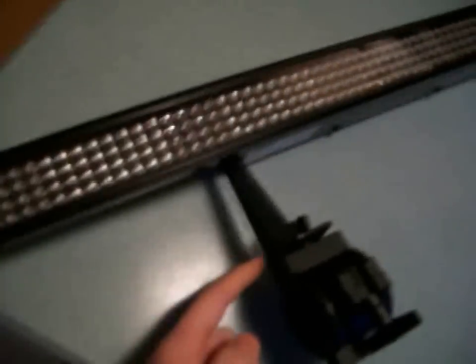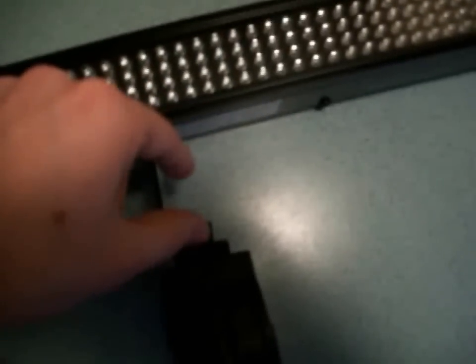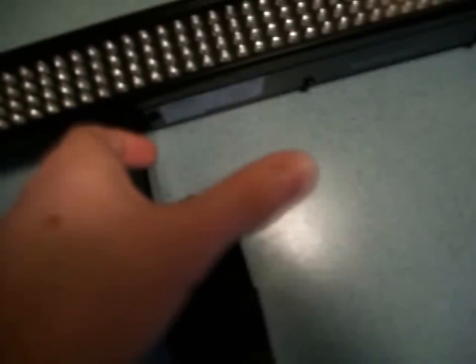You can do one of two things — I'll come up with a few ideas. You can cut this area out just a little bit so that the wing nut can turn. You can put a regular bolt on there. Or you can go out to Home Depot and get the wing nuts that have the high wing nut — instead of the wings going out to the side, they go up high instead.